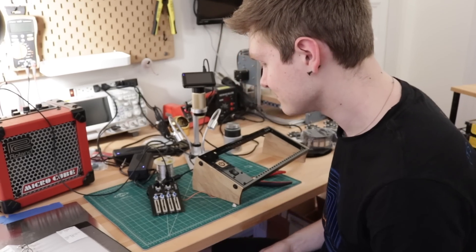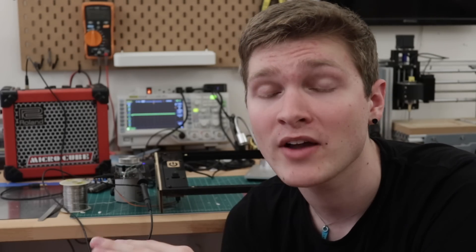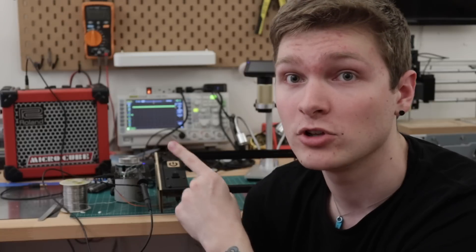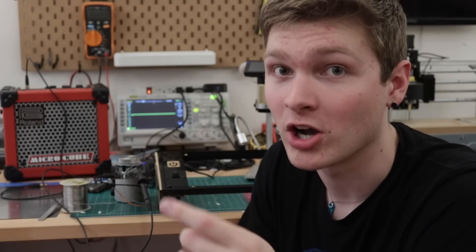It never works on the first try. Never. What I'm doing now is something I do whenever I'm trying to debug a circuit - I step through sequentially where the logic of the circuit is moving and try to isolate down my variable. When I first populated this part I just threw everything on and hoped it worked. Now I'm starting with one part, testing that, and checking to make sure it works. Then if everything looks good there, I'll pop over to the next part, and as soon as something starts not working the way I want, I know what the problem is. So what I've got wired up right now is just the first 555 timer - the very beginning step of the whole process - and if you look at the oscilloscope right there, it looks like it's working pretty well. This is our tempo and that's working. Now I'm going to move on to adding the decade counter, and as long as that's working, we'll move on to the last 555 timer and eventually find something wrong and fix it.